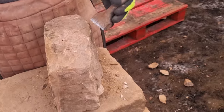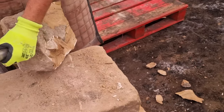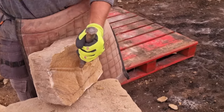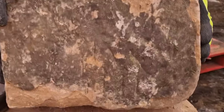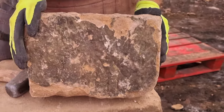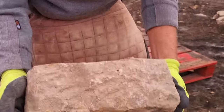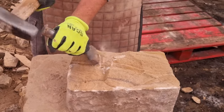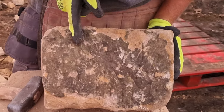That leaves the stone with a nice flush back, and that way it doesn't protrude into your cavity. That is your face — close into the face of the stone. It's called punch face because of the indentations. When the block was originally delved it would have been all rough like the back, and they would have gone across the face using the chisel in motions like that to flatten it off, then used a point chisel to punch the indentations out.